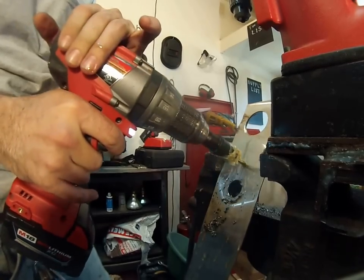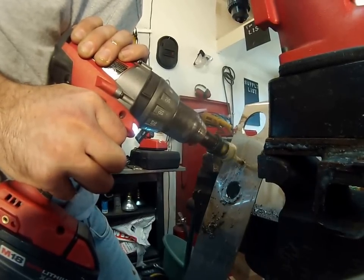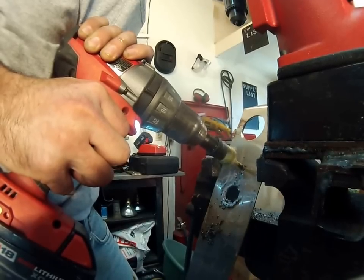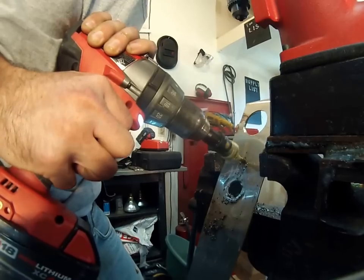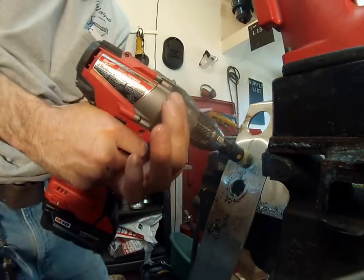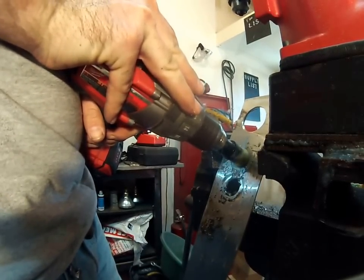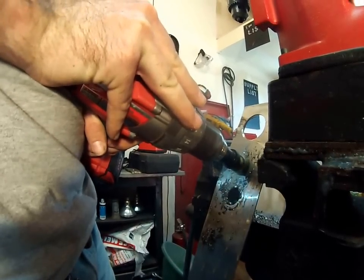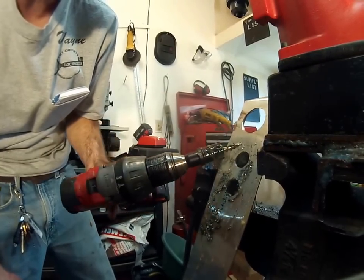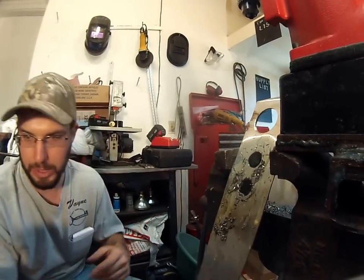I might have to spin it to get it done first. I'm actually going to set the brake to brake on this when I pop through. Okay, so now we're going to go back to drill mode. Just like butter — and the plug got ejected from this automatic spring ejection system. So this hole is much, much cleaner; it's almost like it's a regular machine hole in there.